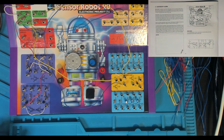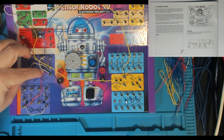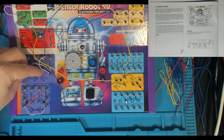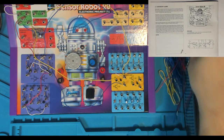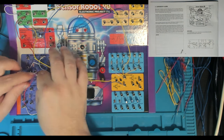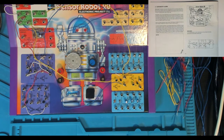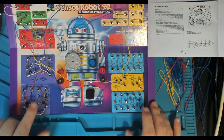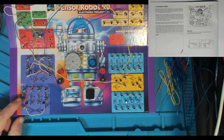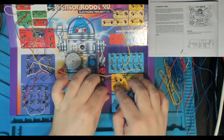Then 32 to 36 — that's the emitter of Q1 to the base of Q2, our Darlington transistor setup again, same as before. Then 41 to 67 — 41 is the tricky one, hard to see. 67 over here is our ceramic capacitor, so that's the collector of Q3 over to the ceramic capacitor.